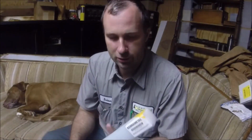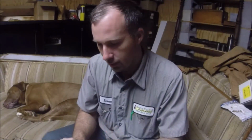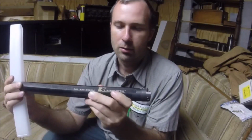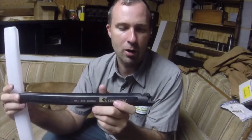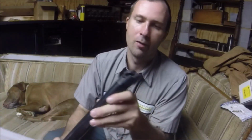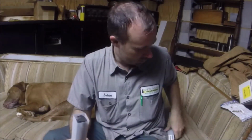Now for those that follow my channel doing that clutch project, you know I got into doing some outside turning, and my lathe only runs one way. Didn't want to rewire it, so I did manage to locate a new old stock twin to my boring bar that I use all the time pretty much, except this is the opposite hand. So got that picked up. Very reasonable price for a brand new one. It was like $60 something. So I'll add that to the tool cabinet.